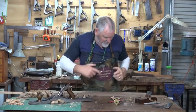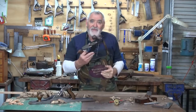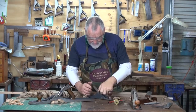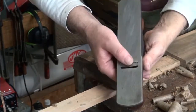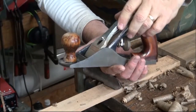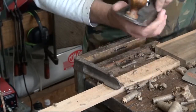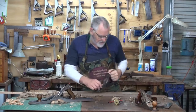That's actually got quite a bit to come off yet, so what I might use is a scrub plane to start with. If that's a little bit too aggressive, I'll go over to what I call a hogging plane. Now if you have a look at the blade on the scrub plane, you can see it's pretty aggressive and it rips huge amounts of timber out. Whereas the hogging plane, which is basically a number four with the blade ground with a bit of a round on it, that's not quite as aggressive as the scrub plane. So I might try the scrub plane first and see how close I get to the line.